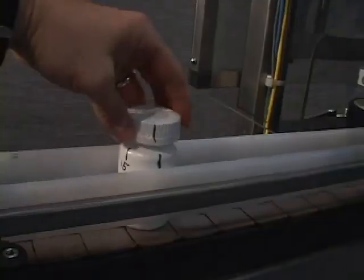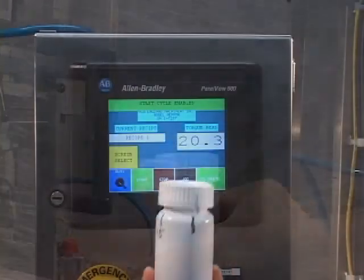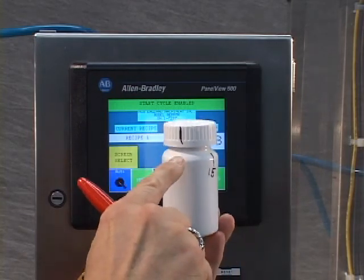The NEP-MTR has an integrated NIST certified transducer which allows the operator to set a torque set point via the HMI control. The torque can be read real time via the HMI screen.